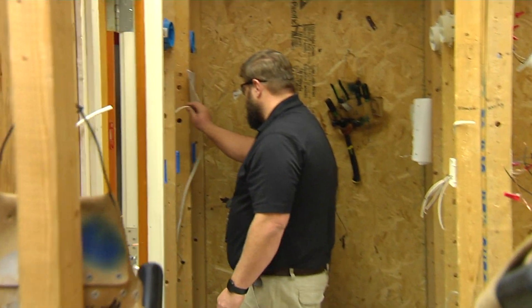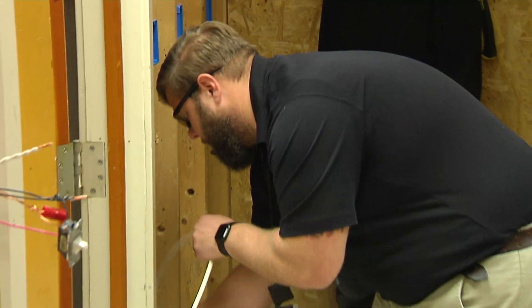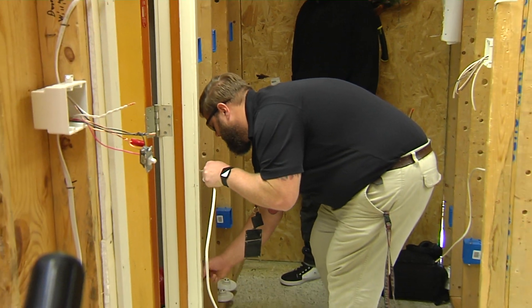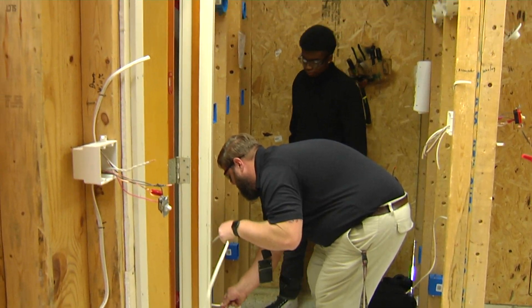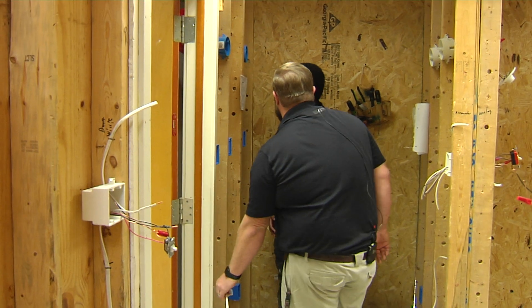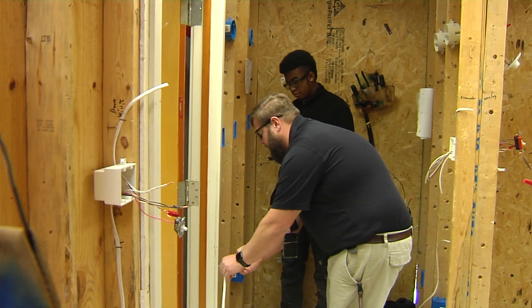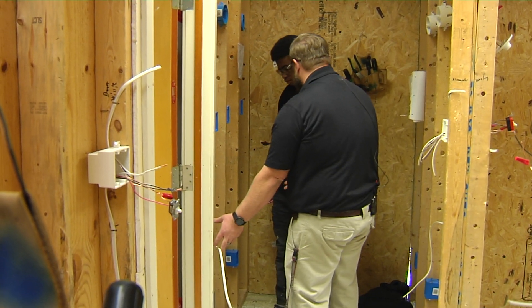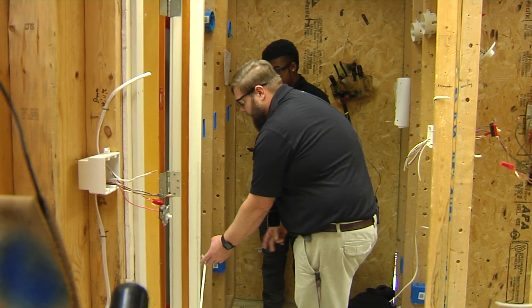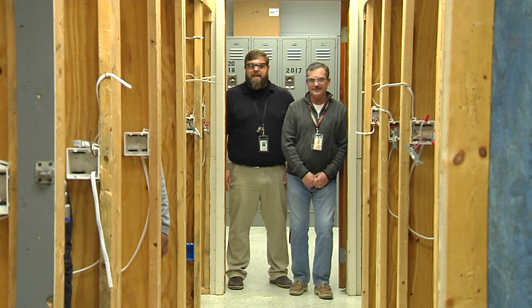So let's go ahead and hook this one up first — we'll put it into this one. This will be your home run, so this will be the feed. If this is your feed coming in, is this going to be line or load? Line. So staple it here, cut it, then run another wire from there up through into that and that's going to be the load. Your GFCI will go here, and you can cut it and staple it right there for your panel box. Good job. Thank you guys for watching, hope you enjoyed the lesson and enjoy your day.